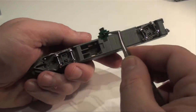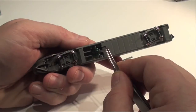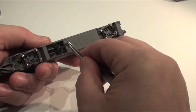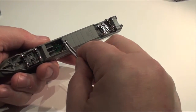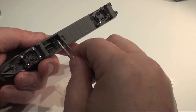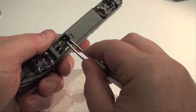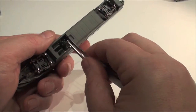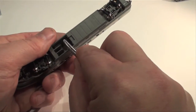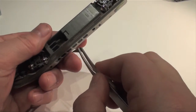I've done a couple of trials at this to make sure I can insert it. It actually doesn't need to be forced in, but it is fiddly, of course. I'll try to move it so you can see the light. What I found is actually pushing down on an angle on the bottom strip and slightly pushing, not setting it in like this and trying to slide it forward. I found that didn't work, and I tried with greater and greater amounts of force, and it didn't work. But you've got to put a little bit of pressure down to push. What you're doing essentially is putting these contact strips between this brass contact rail and another one that you can barely see the tip of right here. Not sure how well that shows up in the video.